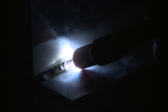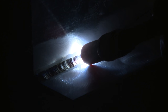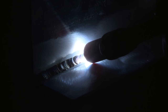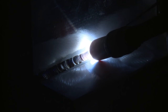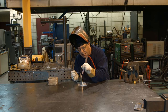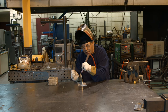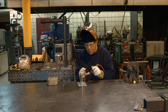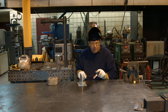For the right torch angle, the right arc length, and being able to introduce the wire, this is pretty simple. I'm hanging on to it back here — I don't think I'd have much fun getting right down close. Working up here on edge, I have a lot of good control, but on some of these long welds they're going to get hot, so I like to get my hands back away from it.